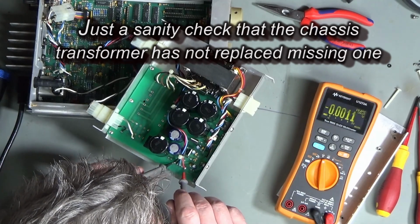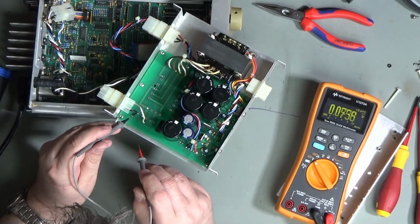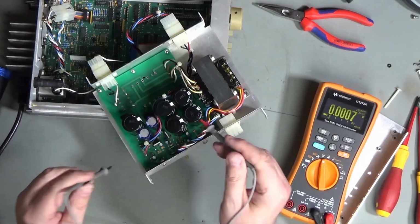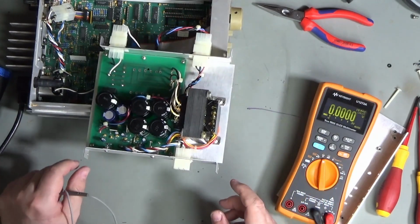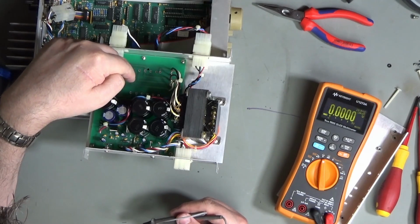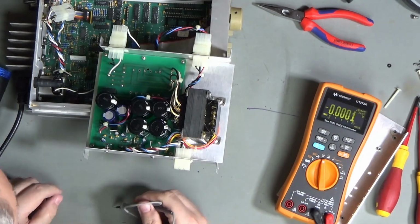And so, kind of as expected, we're not getting anything on any of those. Back to AC, and we'll just check the power's getting to the board, which it is. So we've definitely got no inputs coming into those, so yeah, we're definitely in the world of transformers. But actually that might not be too bad, because that therefore isn't the big heavy current source.